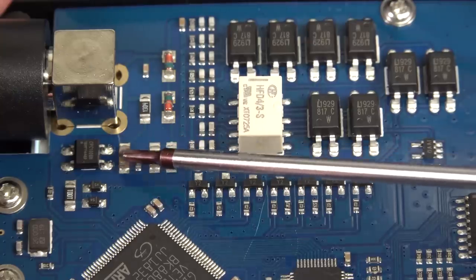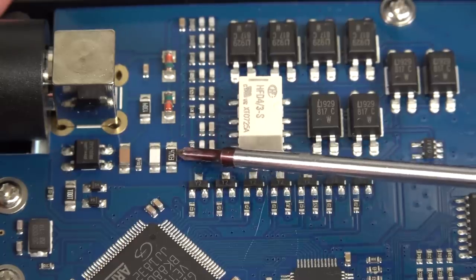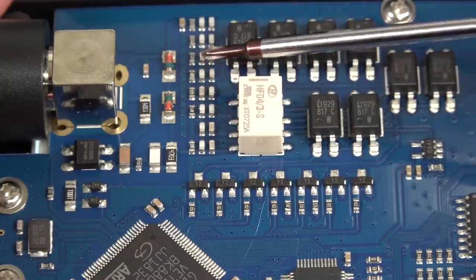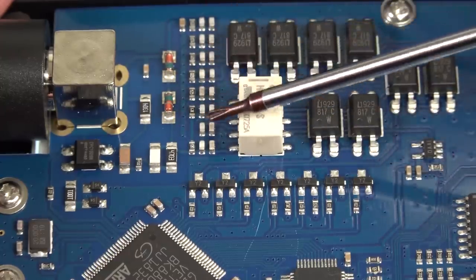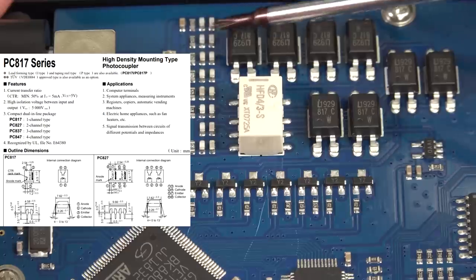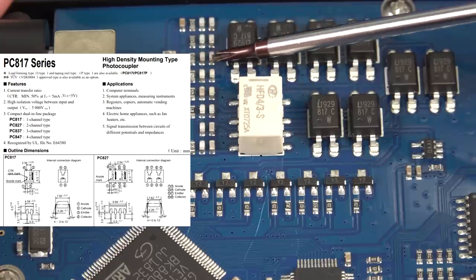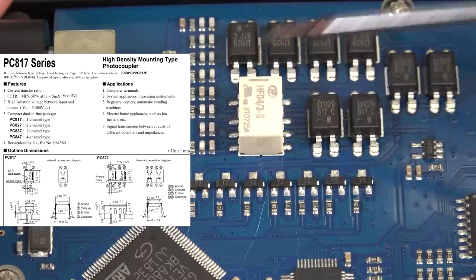So the signal's coming in like this. It's being AC coupled like this, and it's being divided, this input divider resistor here, and then you've got this long divider chain here, and it's all compensated. It's got double compensation caps on each one, and then you've got the input capacitance of all of your switches here, which these taps, one of these taps, so we've got one in the center of that, 1, 2, 3, 4, 5, 6, 7.